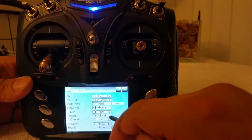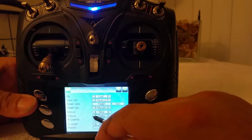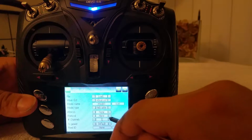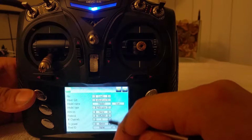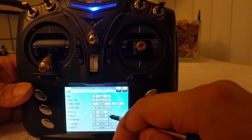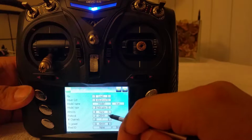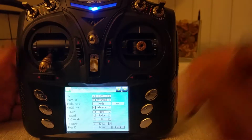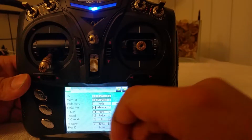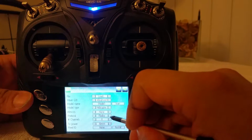All right. Here's this right here. This is your protocol selection. This is going to be very important. This is what allows you to fly your different brands. So protocol is your meat and potatoes of this radio, and the adding the modules. So here's your Devo. Here's your WK2801. That's the older Walkera. Then you got your other Walkeras there. This is your DSM2 and DSMX. That's good for a lot of Horizon Hobby brands, such as the Nano QX. Moving on, you got your J6 Pro, your Fly Sky. I actually can control most of my RC cars with this protocol, although I don't find this radio ergonomic for car driving, but whatever. Just letting you know that it is possible to bind with other vehicles as well, just as long as it's 2.4 gigahertz band and the protocol matches.